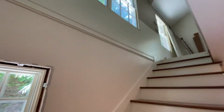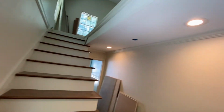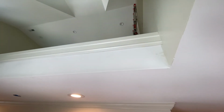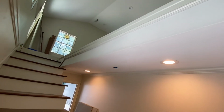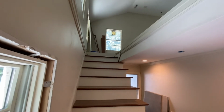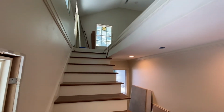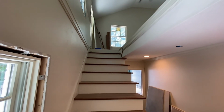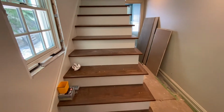It's going to get some nosing around this side. Yeah, he actually took the nosing home today. We're not gonna use the nosing like they made it. So he took a piece of baseboard, put that on upside down. That's going to go underneath the nosing. Trim that out, and then he created a board there at the end to catch that base, and also to kind of finish out the end of the stairs there. So that's going to look really, really nice.